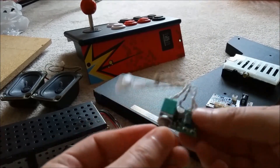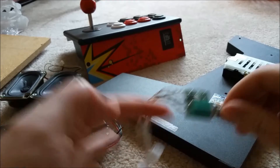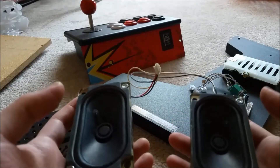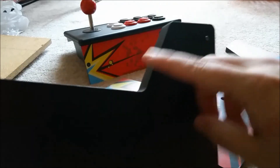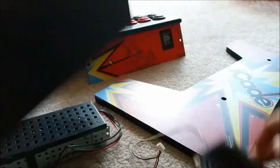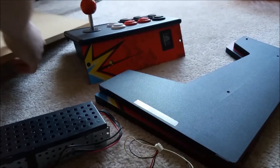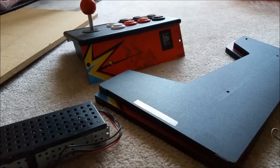I have a dual 3-watt digital Class D amplifier with a nice little volume knob. I'm going to chop the connectors off and wire them to these two speakers, which are going to sit right below the top portion of the arcade cabinet facing downwards. I'll need to cut a little scrap wood for that — I pulled some MDF from an old speaker — basically just chop it up and insert it underneath so I have something to mount the speakers on. That'll take care of audio.